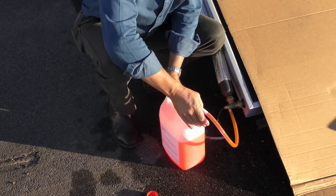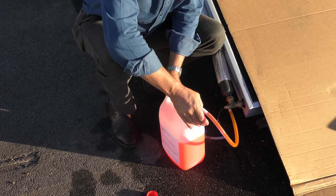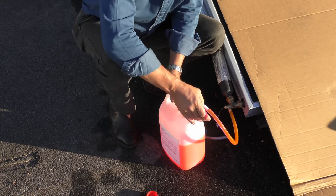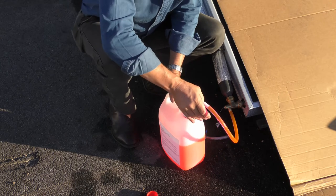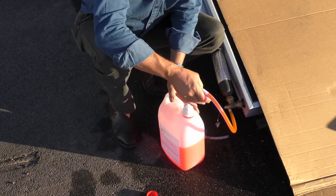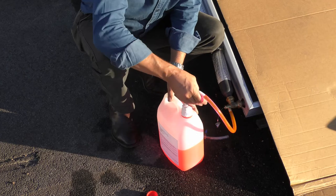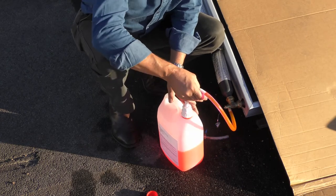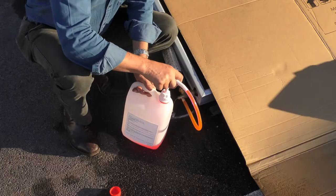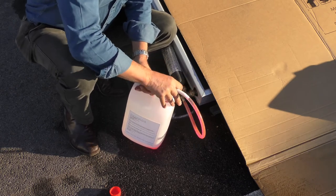It's pretty important if you're in a frost area and you're doing a job like this in the middle of winter. We're quite late in the afternoon now as you can see and it starts to drop in temperature pretty quickly. So if you had a cold snap that night and it wasn't circulated properly because there was no sun and no energy in the thermosyphon action that kicked in, you could find that your collectors have got partially mixed heat transfer fluid — and that could cause the problem we're trying to prevent. Because then you would get spotting frost or freezing in some areas of the collector. So it's important that you mix it properly. Make sure you get as much out as possible — it's important to put the full content in. Don't try to cheapen the job by not putting enough in there.